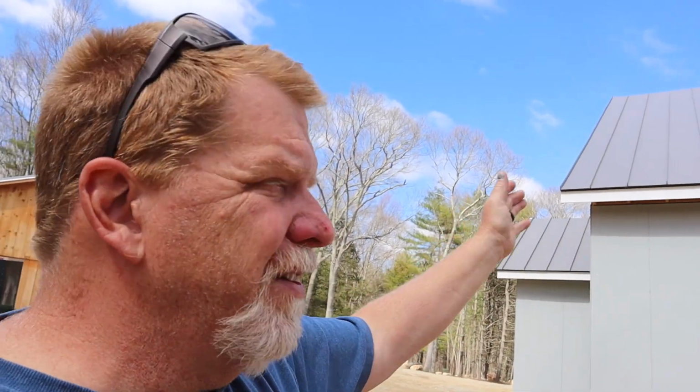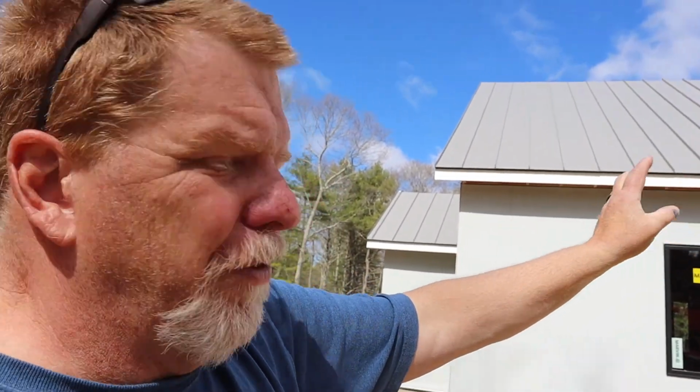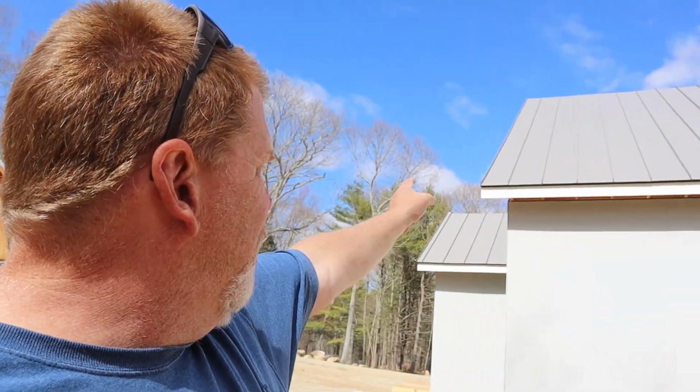So if you pushed all the panels to the edge, you'd have a 16 on one end and an 11 on the other. We didn't want that, so we just took the difference between 16 and 11, it's 5 inches. We split that in half, 2.5 inches. Added it to the 11, we get 13.5 inches. So we've got a 13.5 inch piece here on this end, and we should have a 13.5 inch piece on the other end when we're done. We'll find out next time, I guess. And then they go right across.